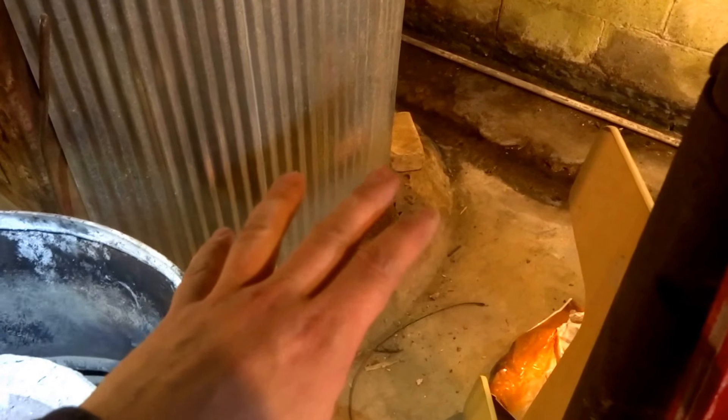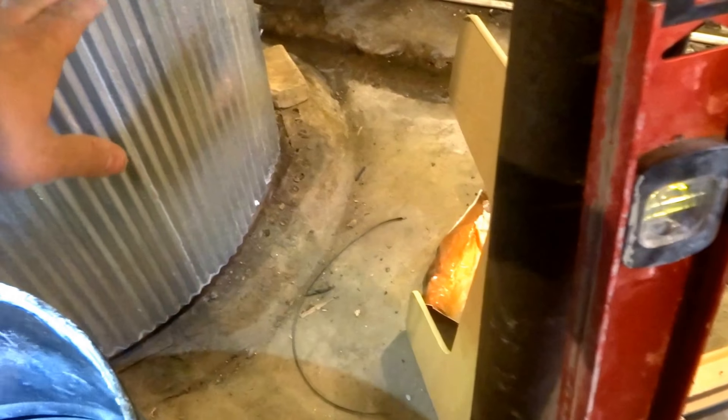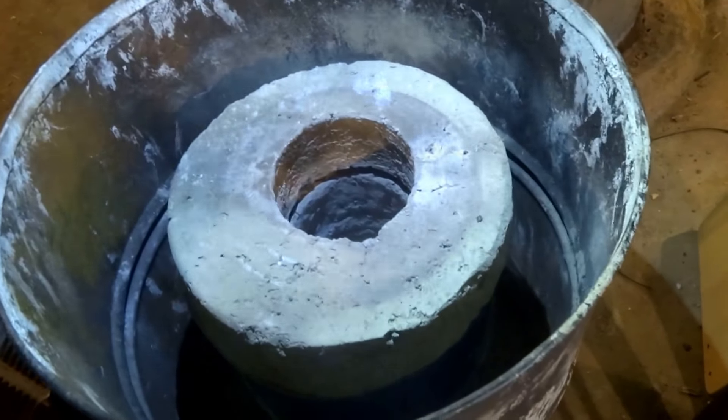I'm planning on using a natural air draw for heating. I'm going to run a pipe through the cob itself with an open bottom to draw in cool air. The cool air will flow through the pipe, be heated by the mass itself, and then flow into the air ducting. I want to see how well that system works.